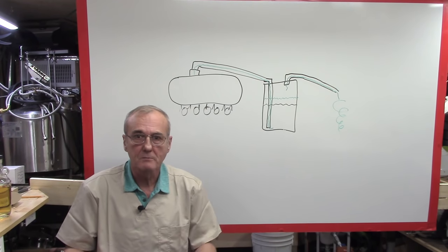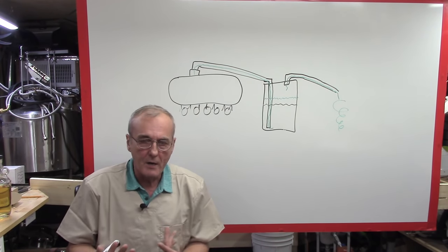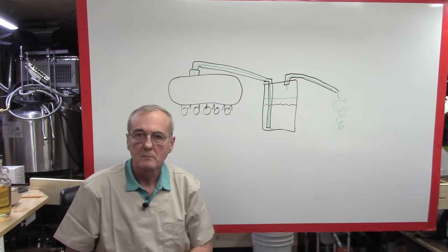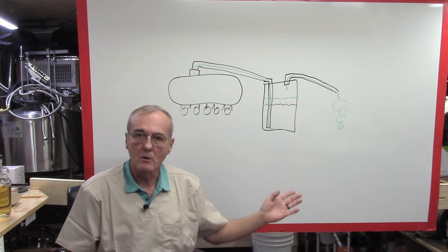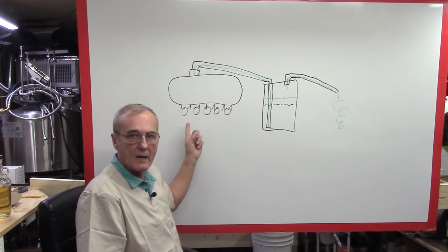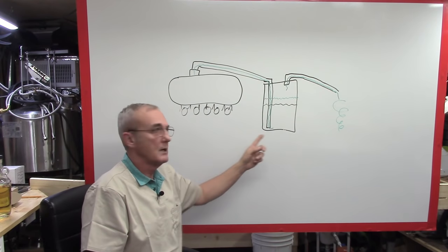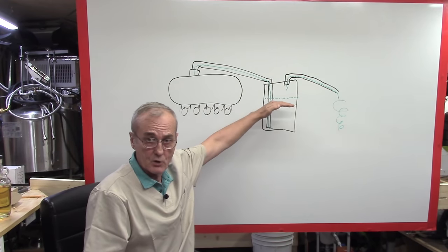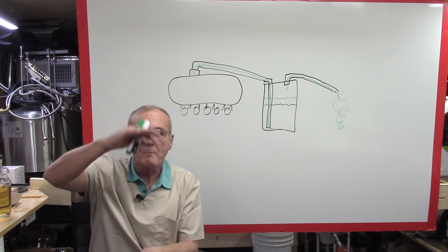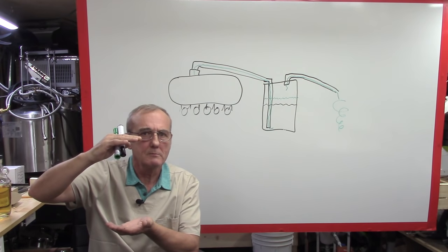And the operator to balance your system. So you'll see nowhere on here in a traditional still lined up with a thumper is there a thermometer anywhere. Everything is run traditionally based on output. Okay? And if you needed a little bit more heat, you added more logs. If you had too much heat, you just allowed that to run and your heat would soon dissipate down and drop on its own because you're losing thermal energy constantly out of the thumper. Therefore, it sort of balances itself. Okay? Are we so far so good? Good.